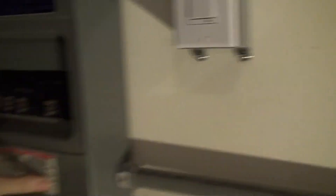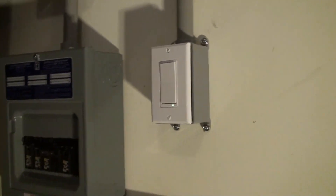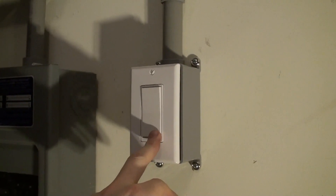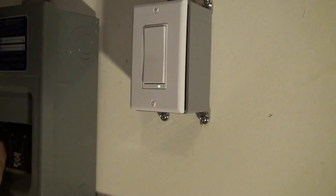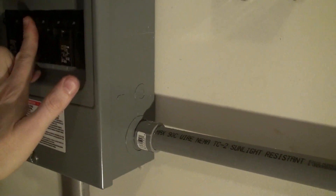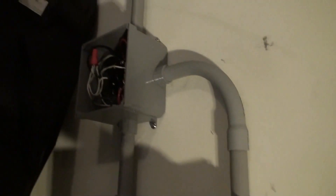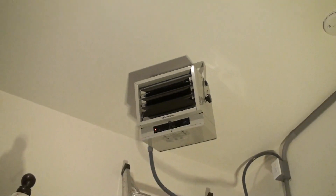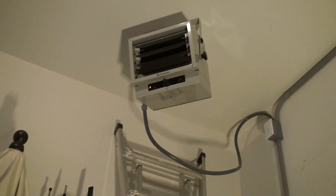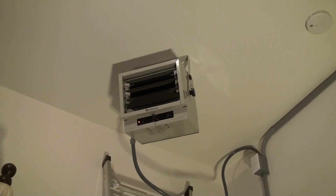Next we'll fire the 15 amp breaker — that controls the light here. Before we turn on the heater, this is the control for the contactors, and this is the Z-Wave switch. Let's hit the heater — keeping that off first. At this point we should have power running to the contactor. We now have voltage. I can actually feel the thing — it's quite hot. I'm going to adjust the louvers, but that's going to complete the project. Thanks for watching. It does have a bit of an echo but I think that's the louver.